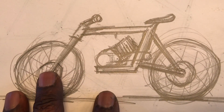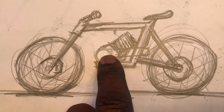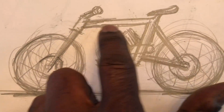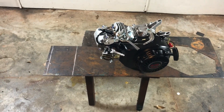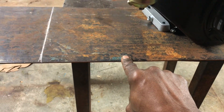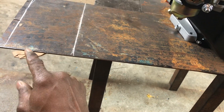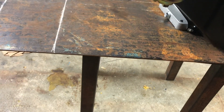This design will give me an idea of what direction to go. The first thing I'm going to do is create the mounting plate for the Predator 212. I'm looking at my plate trying to decide on thickness — keeping it strong but as light as possible. I think 1/8" will work, and the frame will run through it with some gussets to make it strong laterally.